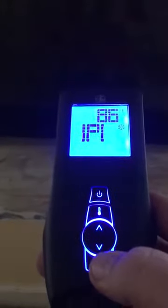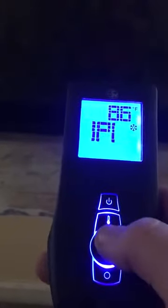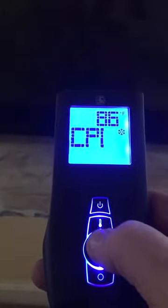One other feature that I want to show you, you have to have the fireplace off, so I'm going to turn it off with the power button, everything goes out. And in the cold months where you're going to be using this frequently, I want you to run this in continuous pilot mode. So right now, when we turn it off, pilots go out. But if I click this button up, it's continuous pilot mode.